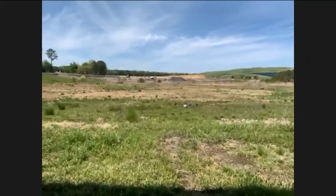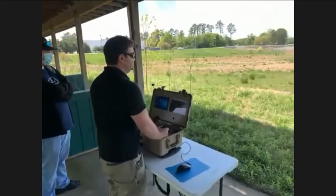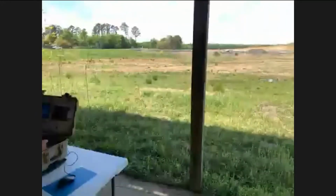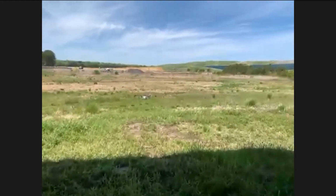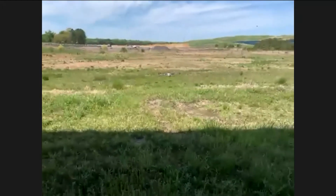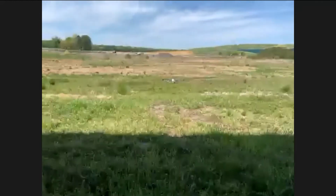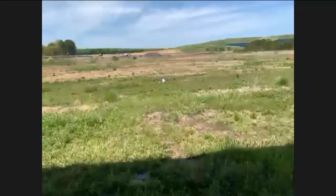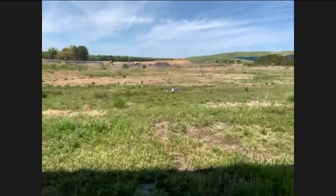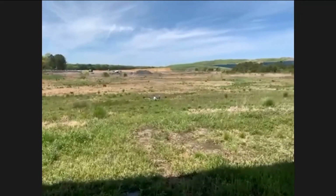Found that we are charging. And notice as he started the aircraft, he did not need to touch it. The generator itself acts as the starter to crank over the engine. So all computer controlled, fuel injected. And he's doing a controls check right now to verify it's responding properly.